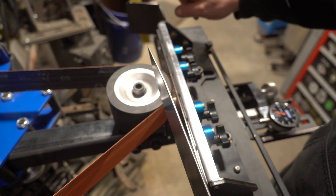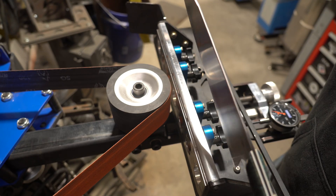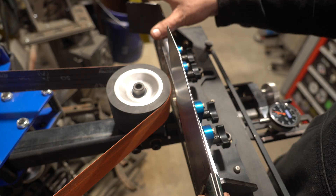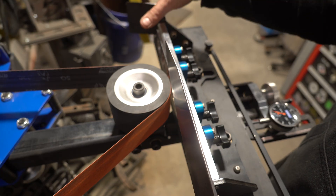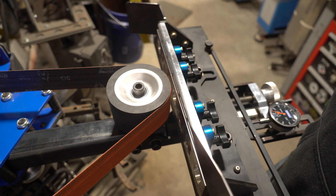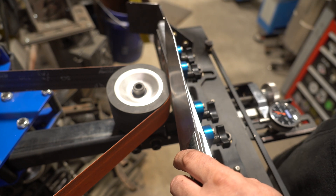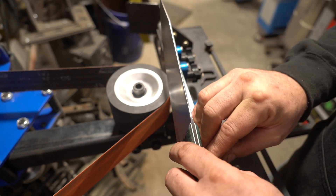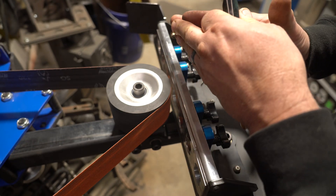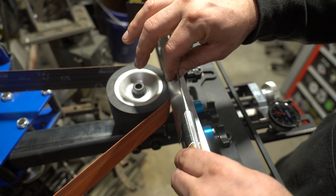If you're actually doing something really long, you can take this guard off — it's just a spark guard to make sure sparks aren't flying off the end. For katanas, make sure you do the front of the katana first and get it down to the taper you want, then do the back half so that it meets up with the back taper on the front half. If you try to do the back half first and then meet the front, you might have it too narrow at the front. So do the front half first, then do the back half and get them to meet in the center.